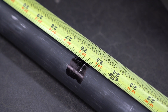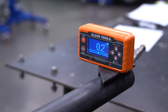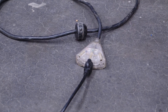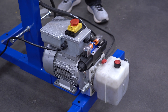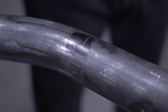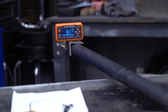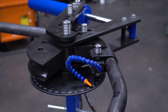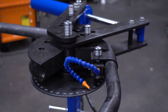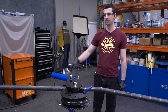We're going to use an angle gauge with a piece of steel and some vice grip pliers to keep this bend in plane, meaning it won't rotate so we won't have a distorted roll cage. This is a prototype electric hydraulic bender. It takes 120-volt power from your wall, runs it through a motor that spins the hydraulic pump, and then pumps the ram out to bend your tube. We got our first bend here, shifted the tube down, aligned it with our second mark, zeroed it on the angle gauge, and we're ready to make our second bend. Then we'll continue and finish bending on the other side.